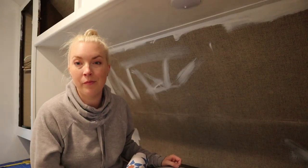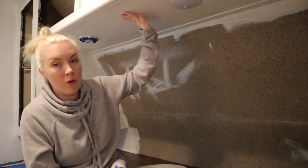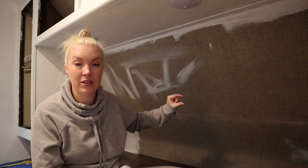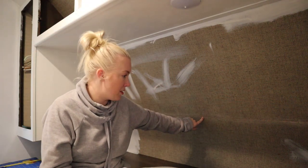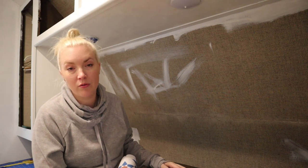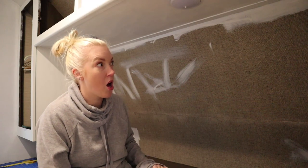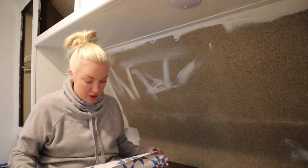I'm back in the master bedroom area. These walls have been cleaned and I've painted oil-based paint all the way around — it's dry now, which is what I was waiting on. Last night I removed a piece of pressed board that was covering a seam. I assumed they put it there because of the curve, but I knew if I put paper over it it would be noticeable, so I just took a screwdriver and popped it off. I thought about filling the line with wood filler, but I don't think it'll be super noticeable once the wallpaper goes up.